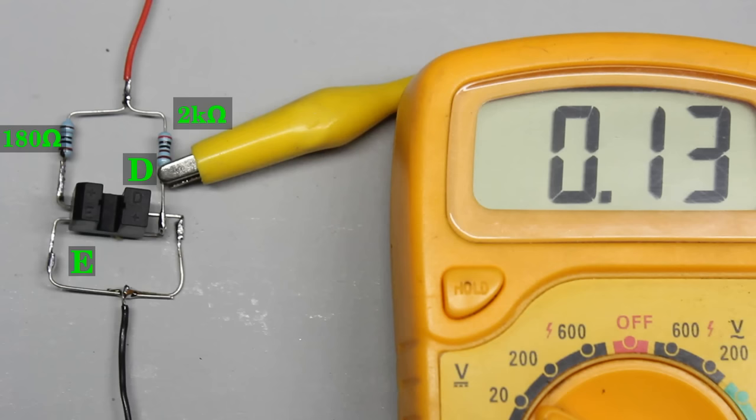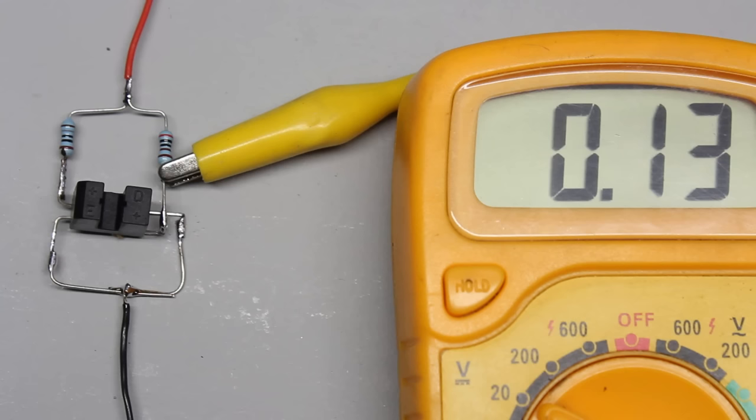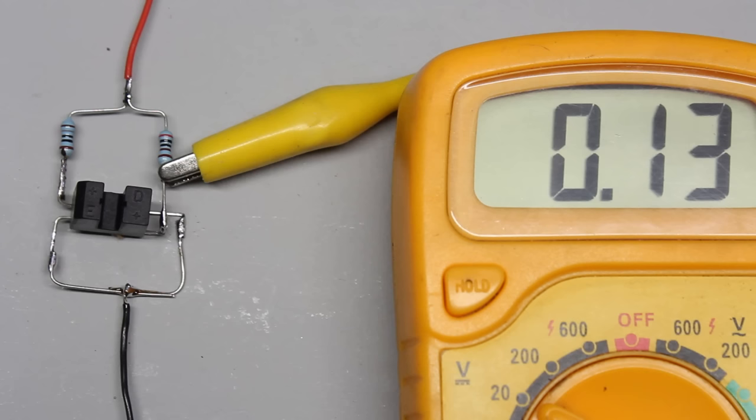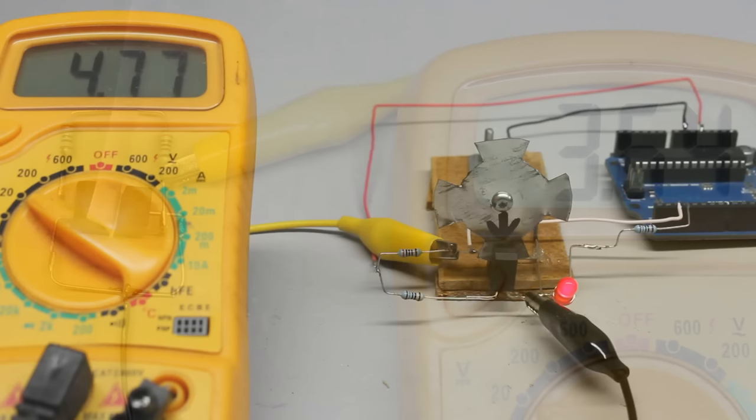In the sensor unit, the infrared LED faces the phototransistor. If the unit is powered, the voltage across the phototransistor drops to almost 0V. The light of the infrared LED has to be blocked to make the voltage step up to almost 5V. I am using a metal sheet cut from a can. Paper doesn't block all of the infrared light, so the voltage doesn't exceed 3.7V.